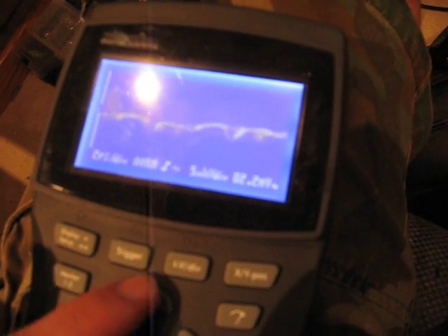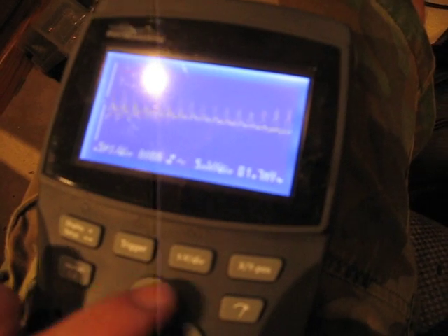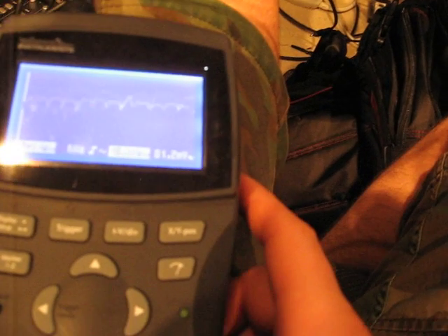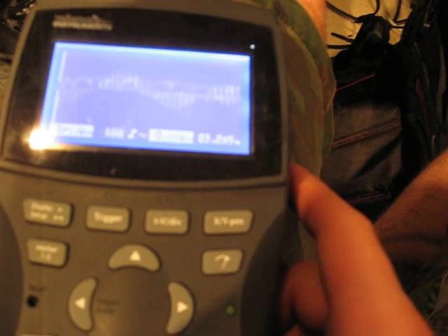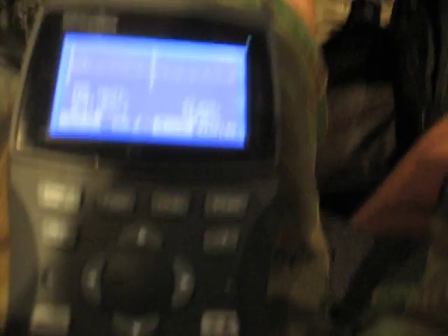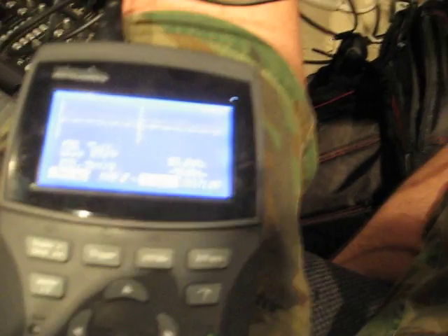Power it on with the thing turned off so that we get a zero reading. There's standard background radiation. If I lock that and switch it to something decent — let's give it 0.1 volts per division — we see no line. It's running about 2.7 millivolts, jumping around a bit. Switching the display mode: 8.3 millivolts. It's negligible power, just regular background readings. Now I'm going to light the candles.